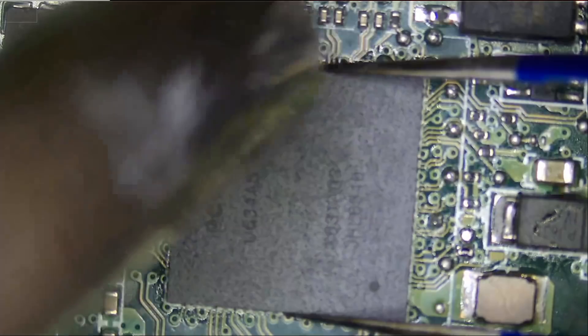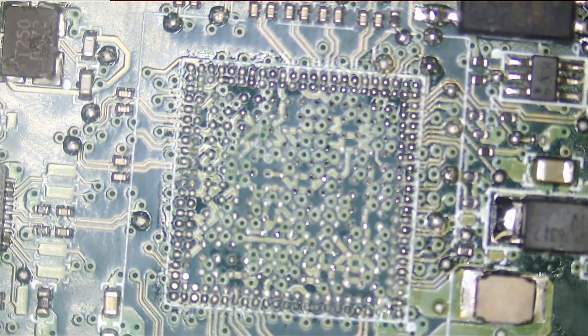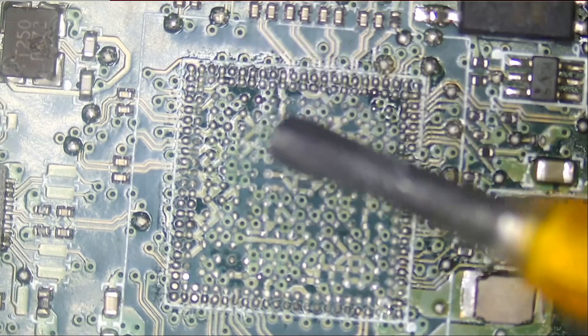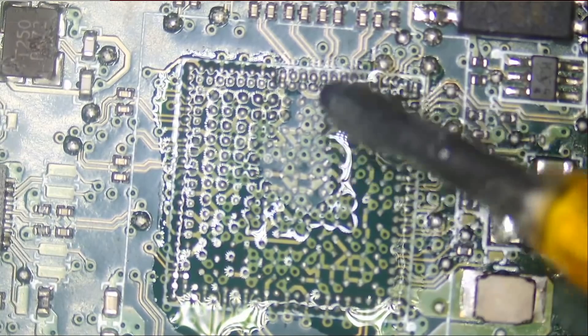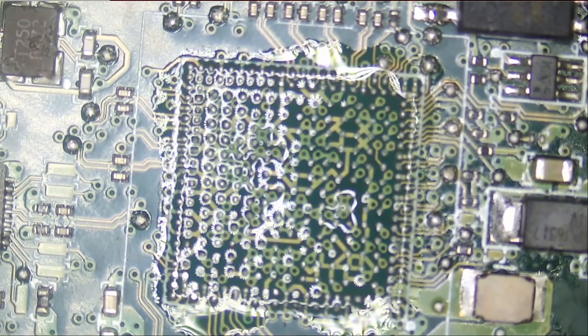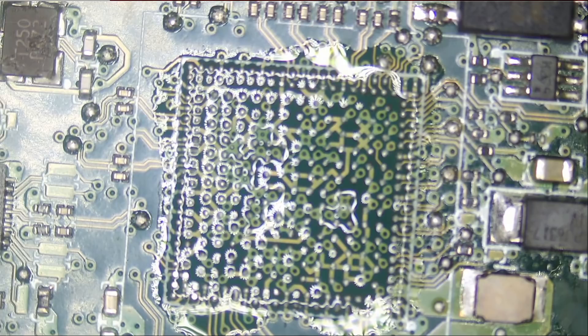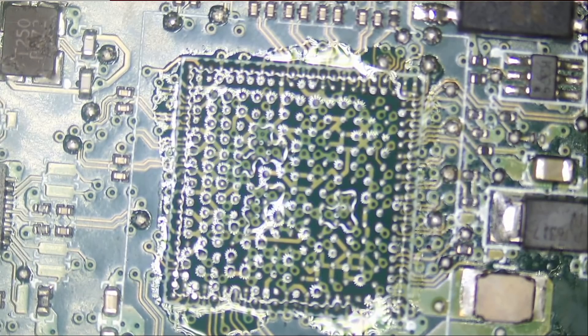I have all three ICs set aside. Add some flux and we're going to clean up all the solder balls from the pads. I'll do a quick clean-up, then remove the Barlow lens so we can zoom in more. When we are zoomed in more, the ring light is closer to the board, and the quality of the image will be better when light is closer. The further away you get the light, the lower the quality — light plays a big role.